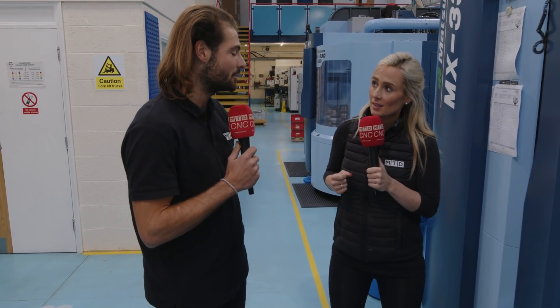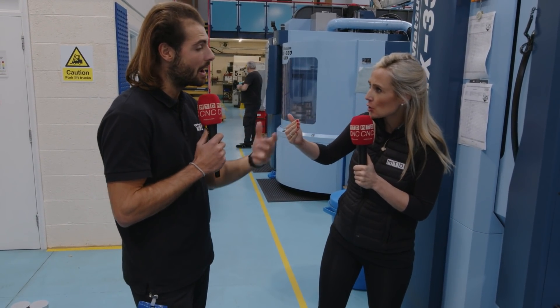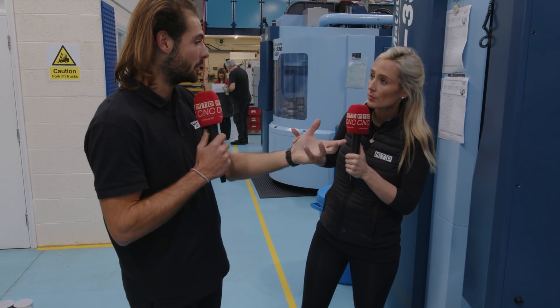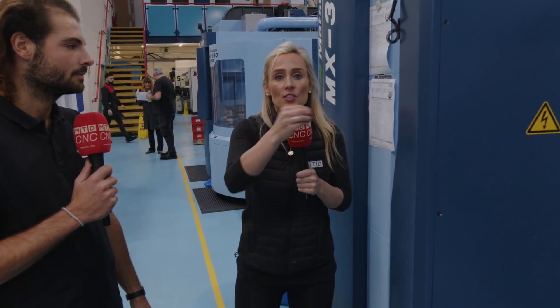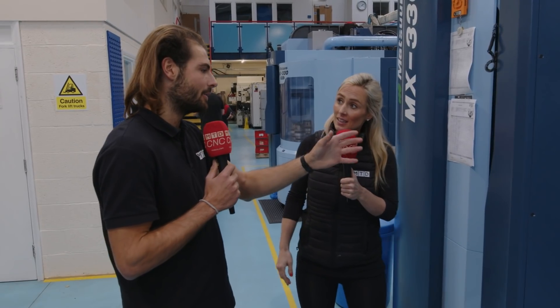Once you've got those two things, you can make these machines absolutely sing. With regards to the probing, it measures all the tools on every set — you can add it before or after a tool change. After a process, these machines are set up to come in and check the tool with a laser probe. That measures the tool length, updates the offset, and also makes sure the tool is actually there. If the offset changes by more than a tolerance you specify, the machine will alarm out. That alarm can go to your phone, so you get told right when it happens. You could have set it up an hour earlier on a Friday night, just about to have dinner, and if something goes wrong you don't have to wait until Monday morning — an operator or yourself can go in and reset it. Hopefully with tool holder technology nowadays and machine accuracy, you won't be getting any tool breakages, but they might occur every now and then because there are so many process variables to think about.